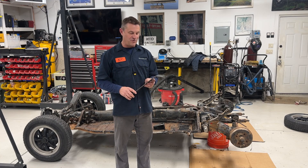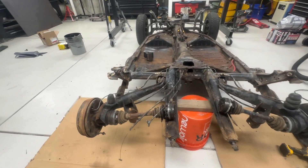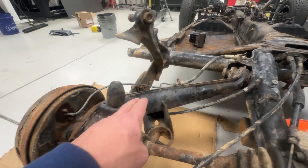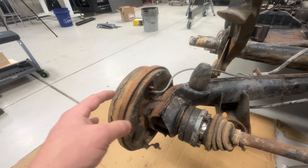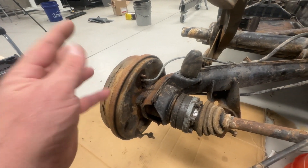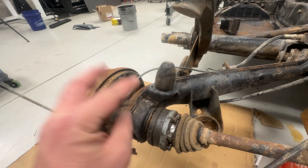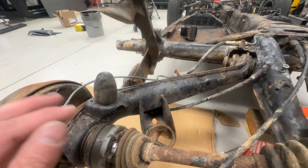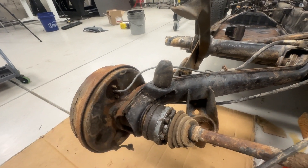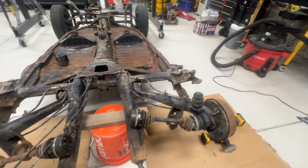Let's get to this build. This is the back of the bug set up on our trusty Home Depot bucket — there's just not a lot of weight back here. Here are the swing arms we're going to be welding these plates to. I've been watching videos of guys taking the brakes apart, but I heard a lot of bad words. Right now the brakes work fine, so I'm going to clean up with a wire brush, spray paint, leave them on, and try welding carefully so I don't transfer too much heat into the bearings. If they get bound up after welding, I'll deal with it then.